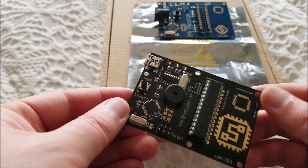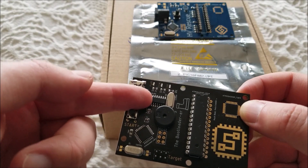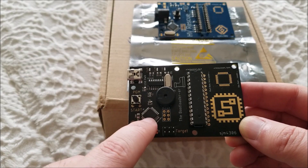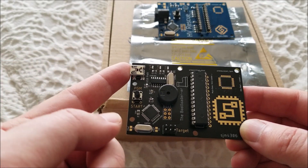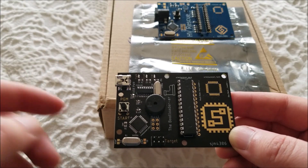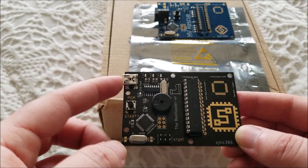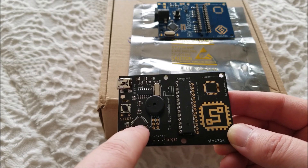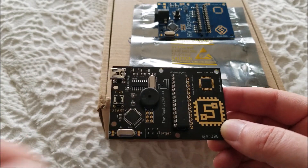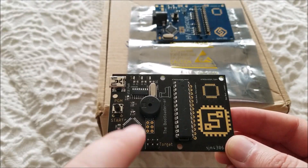I added a few extra things. This little chip here is a CH340G — a USB-to-serial chip. In the Adafruit example code, this host chip gives diagnostic information over serial, so by adding the CH340G I can plug this into a computer, open a serial terminal, and it'll read out information as it reads and programs the chip, including any errors. I also programmed a bootloader into the host chip, so over the same USB line you can flash a new target hex firmware.